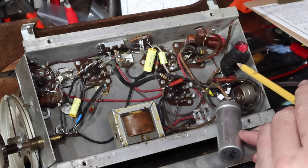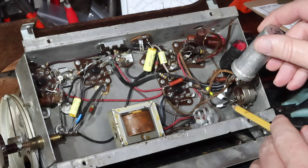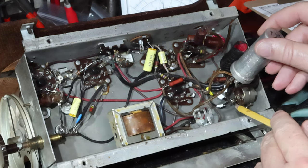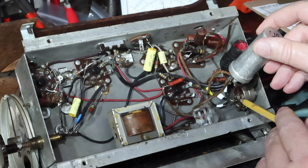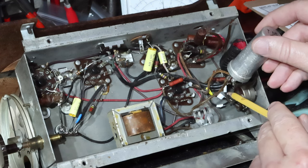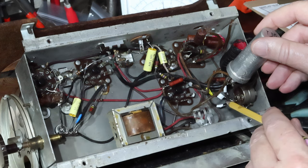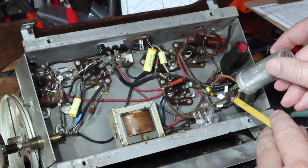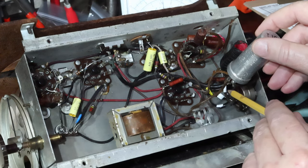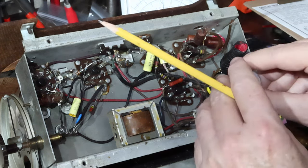okay, so the switch here has all these ground leads going to it on one of the lines. This is the floating ground, and it's used as a terminal tie post. Okay, so I need to get this off of here because I don't want the floating ground tied to the switch. I want this to be the line coming in and the line going out. All right, so what I've done is I'm going to need to move everything that's connected to this. So I've put little white flags on the items that are tied to this point because I want to break them all loose. I want to keep track of all the different lines that go to that floating ground from this point right here when I disconnect them. Okay.